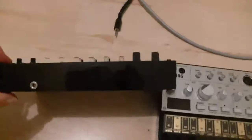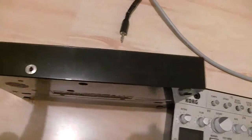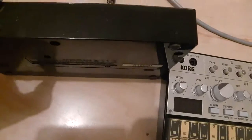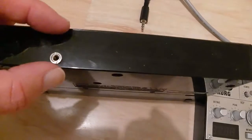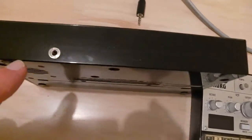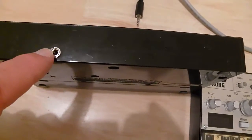What I've opted for is a stereo 3.5mm socket. I placed a bit of masking tape over the surface just to make sure I didn't scratch it. I measured the depth with a dial caliper and made sure I had enough clearance so this just sits on the bottom. When you open it up inside you'll see there are some posts. If the height of this doesn't exceed the height of the posts inside, then you know you've got enough clearance to fit everything in there.